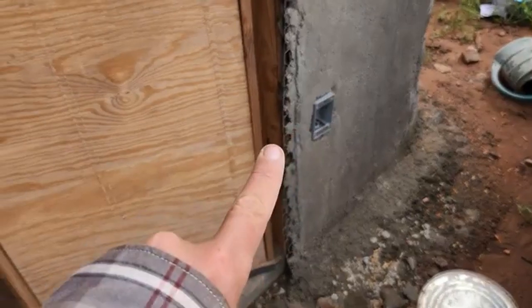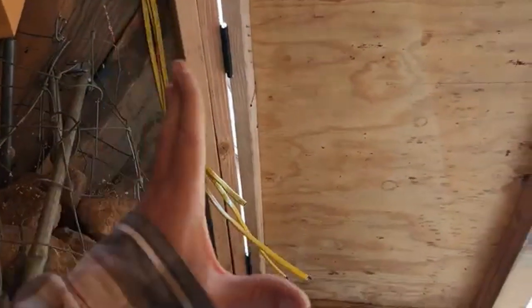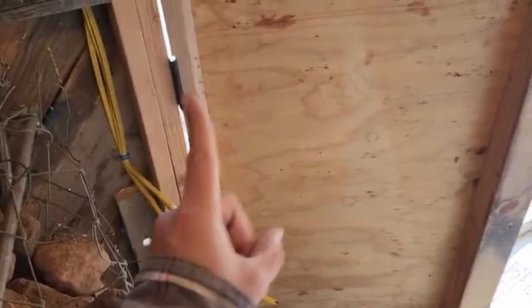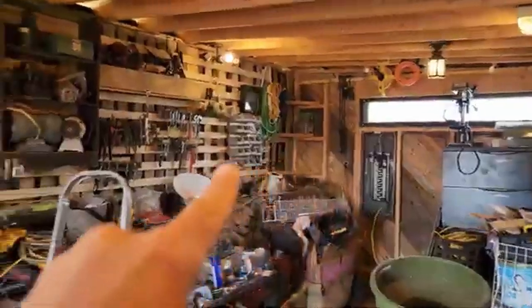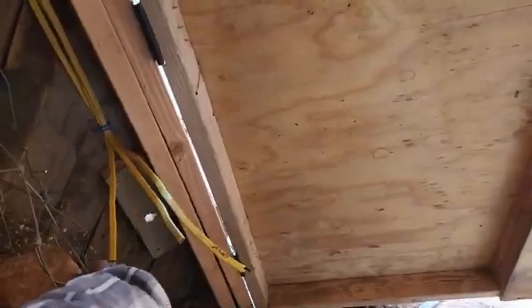I'm starting with the GFCI outlet because it's the most difficult. Basically, a GFCI protects against any kind of water or ground fault. If you put a GFCI first and string all your other outlets after it, all those downstream outlets are protected. The way I've got this wired: we're coming from the breaker box through this wall with our main load line, and then off of this we branch to our outlet here — one wire goes up, back, and around, and the other wire goes up, over, and through the wall to outlets one, two, and three.